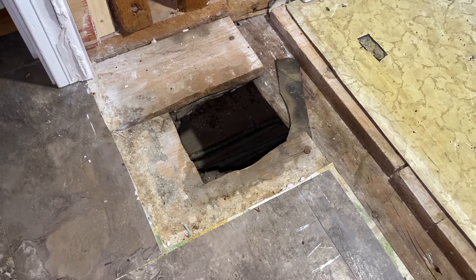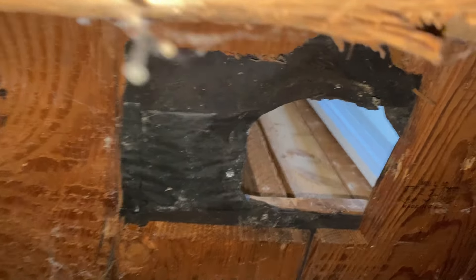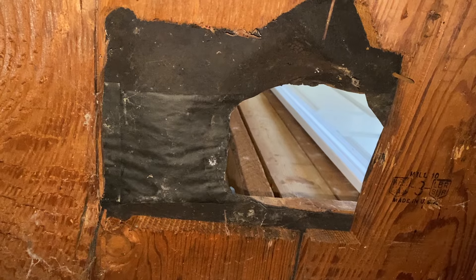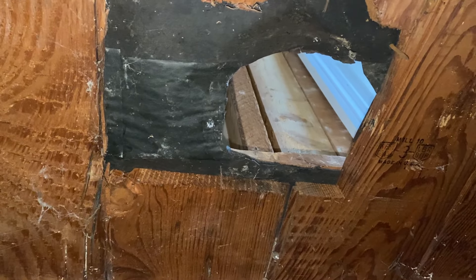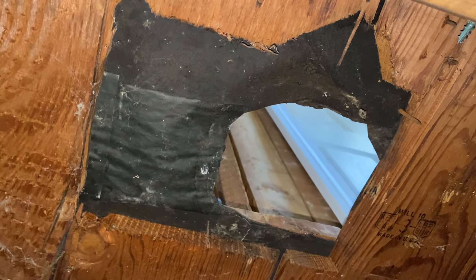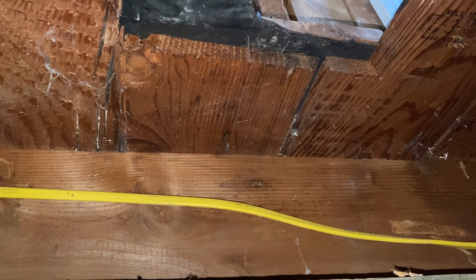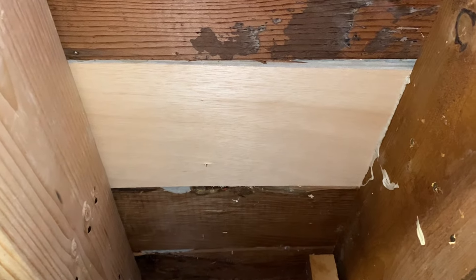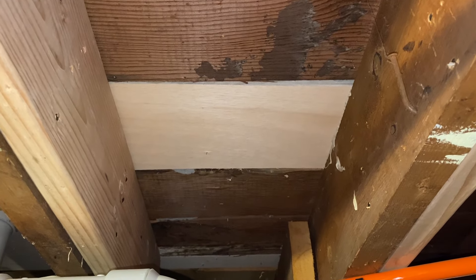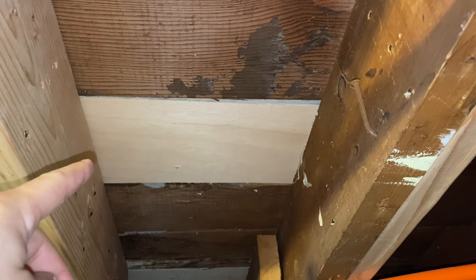Alright, it's time for this patch. This one is a little messy. From underneath, you can see a lot better what's going on here — this was hacked out for a cast iron pipe that went up through the roof, and you can see they hacked up quite a bit of this. The ideal situation would be to cut this subfloor back to this joist. But that flooring up there is the flooring that I can't cut, and besides, that is the old outside wall, and that wall is sitting on top of it. So I'd never be able to cut that half on that joist and get something in there. I did a similar patch over here for the bathroom — I cut the subfloor right back to the joist and filled it in, and I'll leave a link in the description to that video.